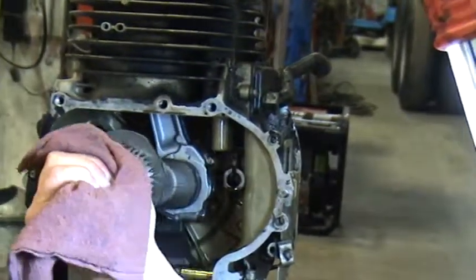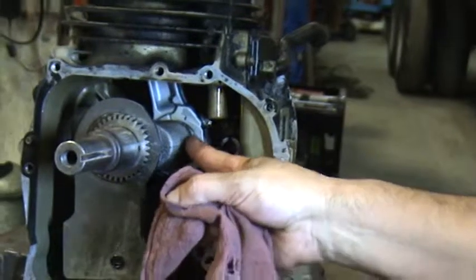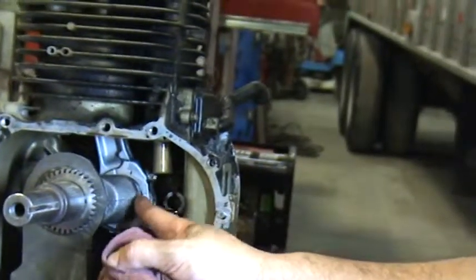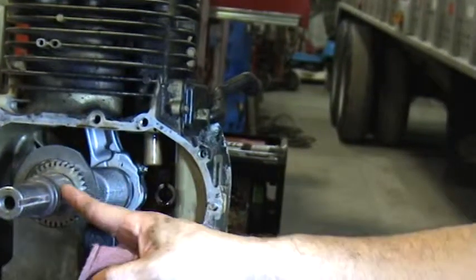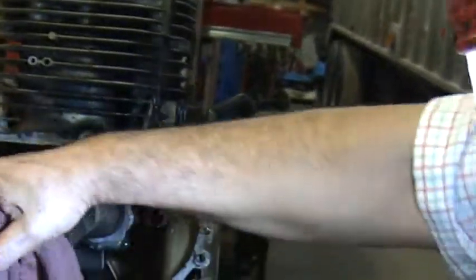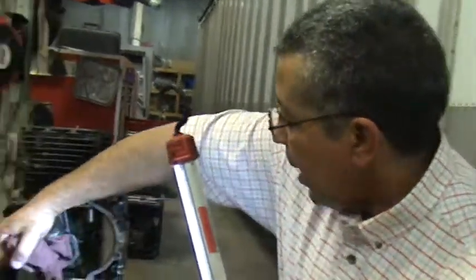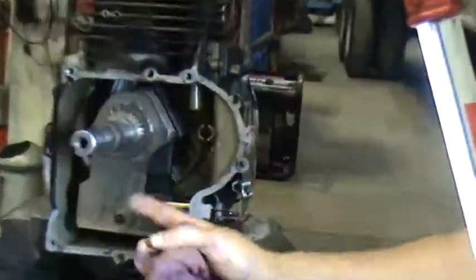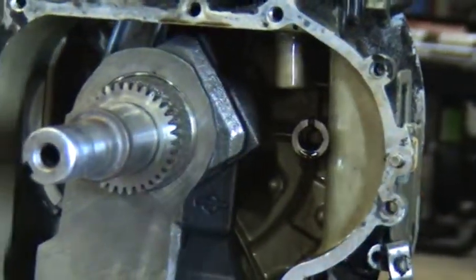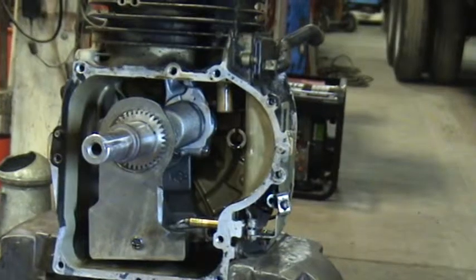But so right here, as the diesel fuel is burning inside the combustion area, this reciprocating engine becomes more efficient. Peak efficiency is right here, and the crankshaft throw is at a perpendicular, or it's offset. It develops a maximum amount of power right here because of the crankshaft throw. From here to right there is its most efficient point. That's when the power is created from reciprocating motion to rotary motion at its most efficient in this engine. And when it comes up here, it's extremely inefficient because the flywheel has to carry this crankshaft through back to its power stroke again right here.